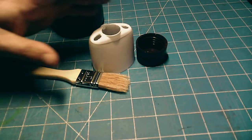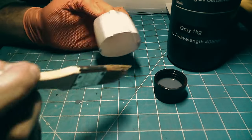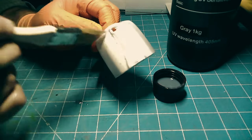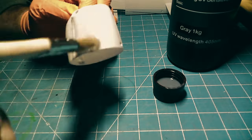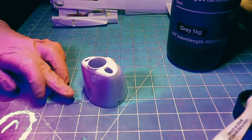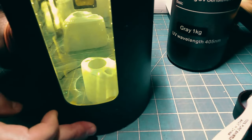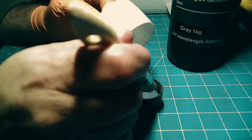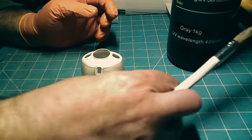So I use standard UV curable SLA print resin, and I brush it on my parts as a method of removing layer lines. The stuff does not dry at all, and you can continue to brush it until you like it, get all the runs out of it, let it flow out completely, and then when you hit it with light, only then will this stuff activate and harden very quickly, within a few seconds. Then you can just simply put another coat on it, and it's very sandable. It really makes the part a lot stronger. So for something like a cowl, I highly recommend doing this.